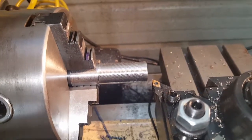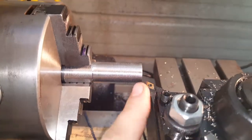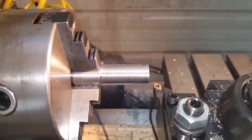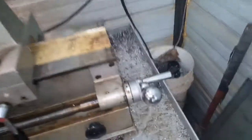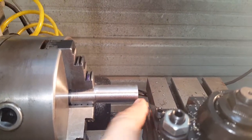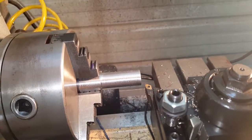Got it faced and turned down roughly. First thing we're gonna do is work on the very end where the bearing will sit on the shaft. There are several ways — you can paint it with layout die and scribe a line. This is a milling machine lathe so on the lead screws we've got divisions. What I do is turn it on, touch off the work, set a zero, disable the feed, lock the carriage, and I'm going in 430 thousandths.